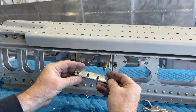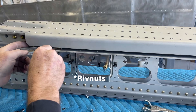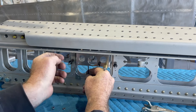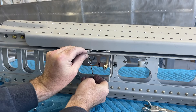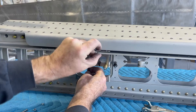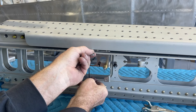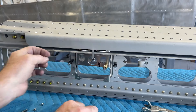So I made this piece of aluminum with these M4 nut plates on the back. Slide it in, get my screw, put my screw in up underneath here, and use this wrench to hold this in place, and then start threading this in. The first one's going to be a little bit of a challenge, but that's it — start threading that in, and then do the rest just like that.